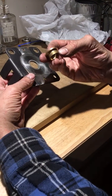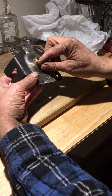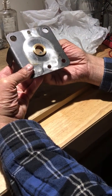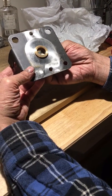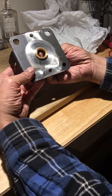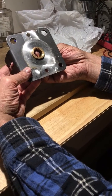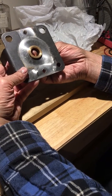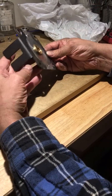In this case — and this happens too often — it'll wear a groove in the bearing. You might be able to see that here. What happens is when the auger turns, the bearing turns inside the end plate, and that shouldn't happen. That can make a herky-jerky auger movement that may feed pellets erratically and may cause or contribute to more pellet jamming.